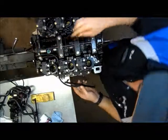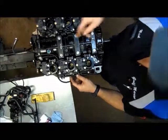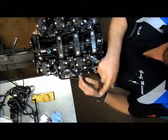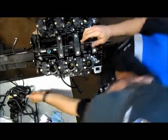This is our balancing tube. It hooks to that lower main. There's a check valve in there. And it runs oil back into the intake. Get that one into place. I still haven't replaced these O-rings. I'm going to replace these O-rings before I begin putting that part together. So anyhow, got that in there, and then we're going to start hooking up all the rest of our gadgets here.